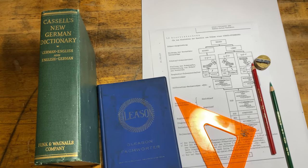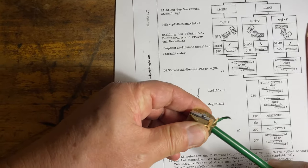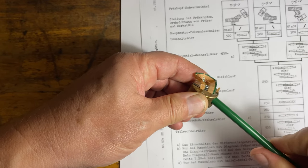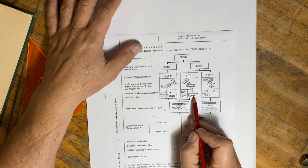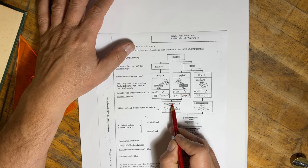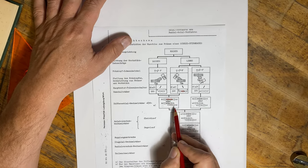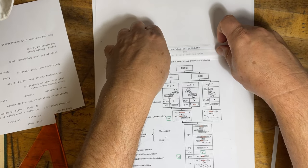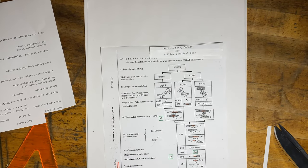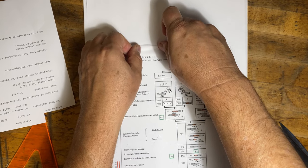I'm not going to go into the change gear calculations for the differential, which follow right along with the way you would do it for index gears — maybe a little more tedious. But the first thing we run into is how to set the machine up on the hob head. It's not very difficult really once you figure it out, but the owner's manual is in German. So get your dictionary out, roll your sleeves up, and get ready to decode the owner's manual. I do have an English owner's manual, but it's not as complete.